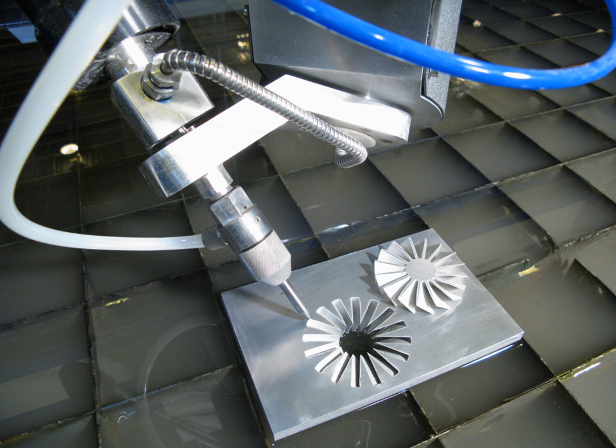By 1987, Ingersoll Rand Waterjet Systems was offering a 5-axis pure water jet cutting system called the Robotic Waterjet System. The system was an overhead gantry design, similar in overall size to the HS1000. With recent advances in control and motion technology, 5-axis water jet cutting — abrasive and pure — has become a reality. Where the normal axes on a water jet are named Y (back/forth), X (left/right), and Z (up/down), a 5-axis system will typically add an A-axis angle from perpendicular and C-axis rotation around the Z-axis.